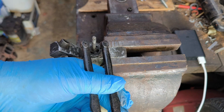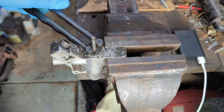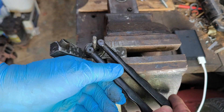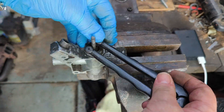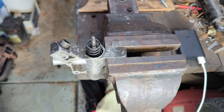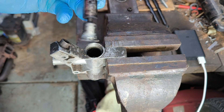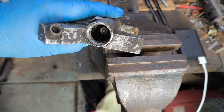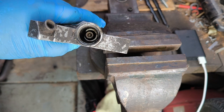I'll use a special tool. So collar coming loose, and this is under spring pressure so at the end it will just pop out — like that. And inside the spring, the cone, and then the actuator is down there. The next job is to get that out. There is a seal down there underneath that shiny steel washer.